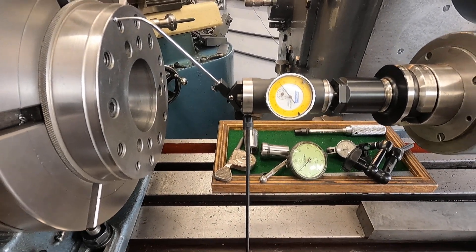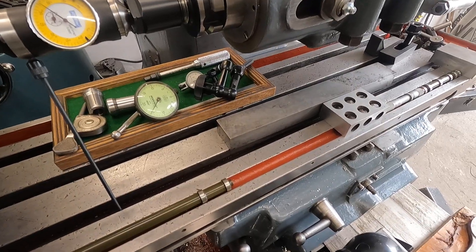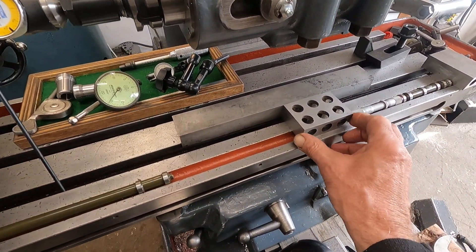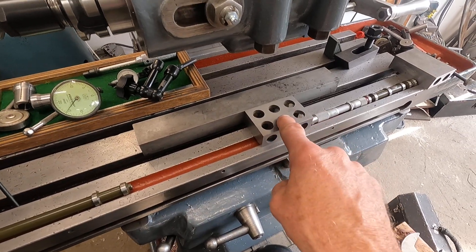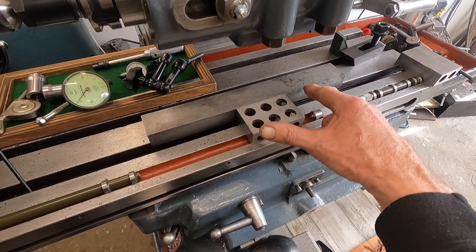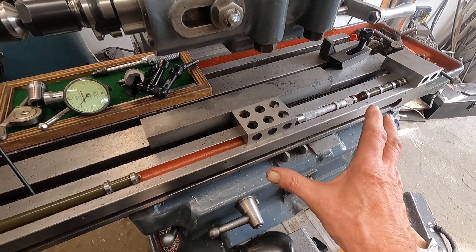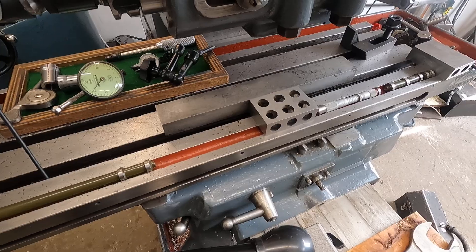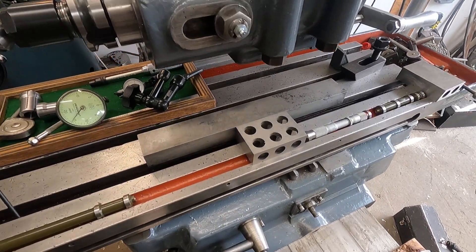On this precision stuff, some people add - it's just some great stuff. Taylor Craft, 1947. He's got different experiences than me and I've never thought of this before. You can eliminate the table movements by spacing - say this is your work and the spindle's here and you're drilling holes - you can space this along a ground bar with end measuring rods in the micrometer and eliminate the table movements entirely. Most of the time I've got something big or odd on the table, but I'll be able to use that. I'm really glad he gave me that tip.